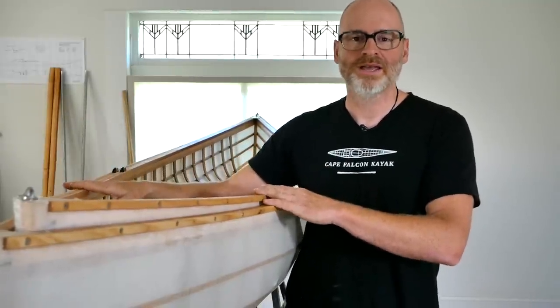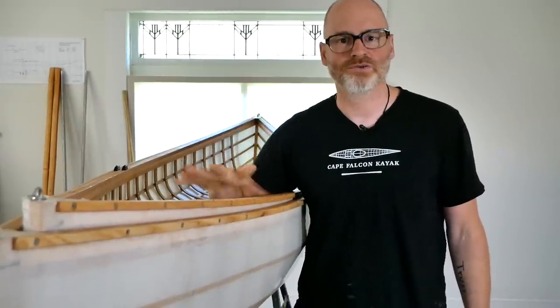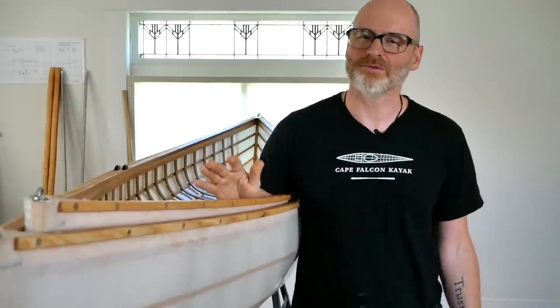With all my other boats, everything works off a proportional system — a mathematical relationship between various proportionalities of the boat and various rib lengths that can be exploited to walk down the gunwales, take a piece of rib across the gunwales, figure out the actual adjustment factors, cut those at that length, put them in the steam box, bend them in by eye, check the keel height, and boom — you've got your hull shape. It's reproducible and works across a wide range of widths and lengths.